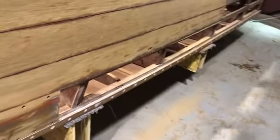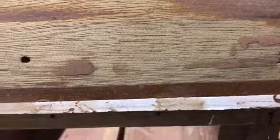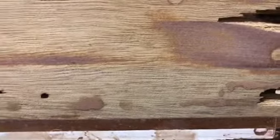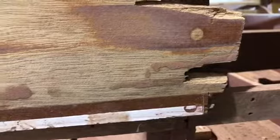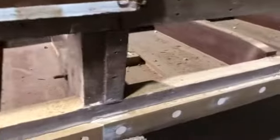This boat is going to have two new planks. This bottom plank is being replaced because it split badly in this back corner. Then this center plank was actually okay, but someone had decided to glue on the rub rail without putting it across the full width of the timber. By doing it that way, they created a cavity in the middle for water to sit and it rotted all the back of it out. There's a right way and a wrong way — clearly this was the wrong way, with all the right intention. This plank will be square-cut up to about here and a new plank section run through, plus a new lower plank — both sides of the boat.